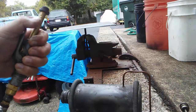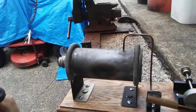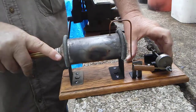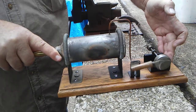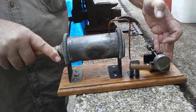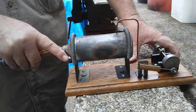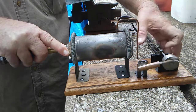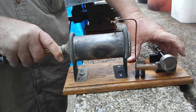I'm going to do this real quick because it's starting to rain. I put a piece of hose on my blow gun here. The boiler does have a leak in it. Let me tip this down a little more so it will show it good. If I put a little air to the boiler — there she is. You could build a fire under it; I ran it on the propane torch. But plumbing solder is not real durable. It's more for show than anything, and to prove a point — to teach. There we go. Now we're running pretty good.